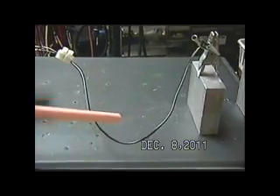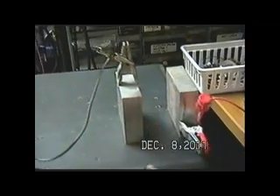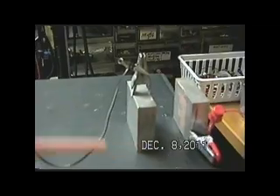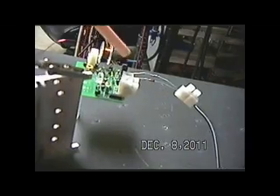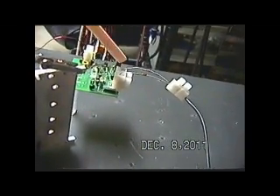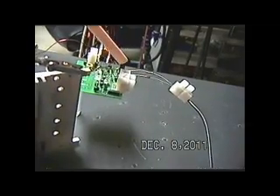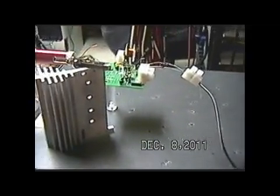What it's doing is acting more or less as a regenerative receiver. We've got a little kick coming off of this plate here, in this wide distance with the 1.5 volts — just enough to start the oscillator. This one has only the 10 microfarad filter on it. If you put 1,000 or anything larger than 10 on there, you're going to waste a whole lot of energy trying to charge that thing up sufficiently to kick-start this exciter.